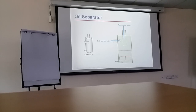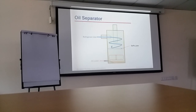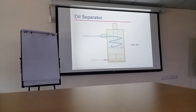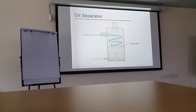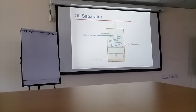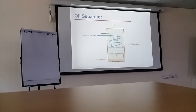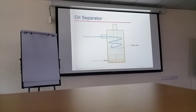Inside, there is noise facing here. The baffle plate may be broken inside. In some cases I have heard about baffle plates being broken, which causes noise. If you see, it makes centrifugal force here — so what happens is the gas goes back to the condenser on the surrounding area, and by gravity the oil drops back to the oil sump.